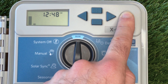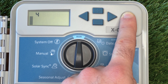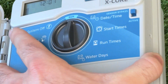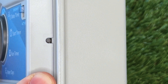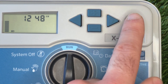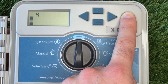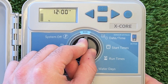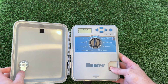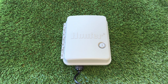One of the most useful features that this controller has is the total reset function. The total reset will wipe all programming from the controller, including the date and time. This can be done by holding the PRG button and then pressing the reset button on the side of the controller — you may need to use something narrow to press the reset button. It's important to note that you hold the PRG button and just press the reset button once, then keep holding the PRG button down until the display says Done. This has now reset all the settings of the controller back to their factory defaults. This reset is super helpful if there are incorrect settings on the controller that you're unaware of — just perform the reset and go back to the start of the video to reprogram the controller from scratch.